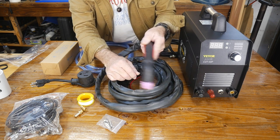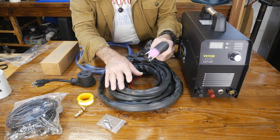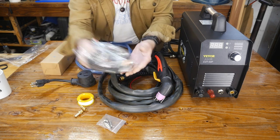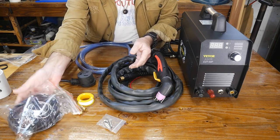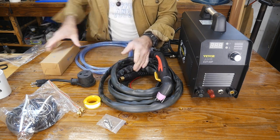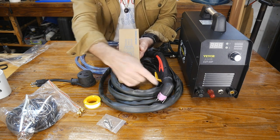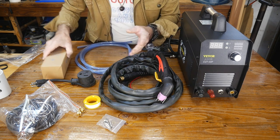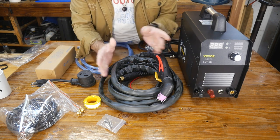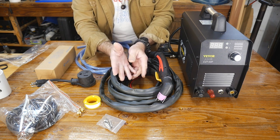At the same time you're also putting air pressure through, so you're blowing that metal through. This thing can scribe patterns in the metal and cut - so you can do some really class-act jobs with something like this. You also have a ground, and you're going to need a good ground because it's like a welder in that part. They also included Teflon tape and a nice little air pressure system, because you're going to be blowing air through here off a compressor.